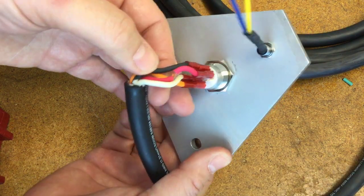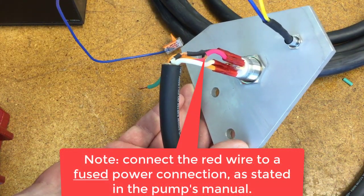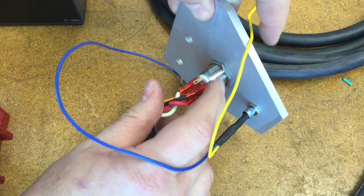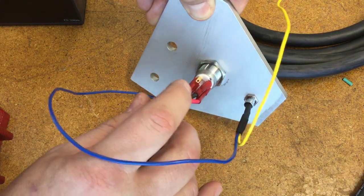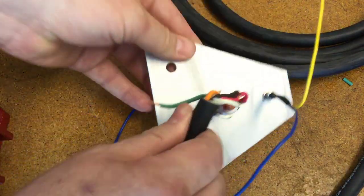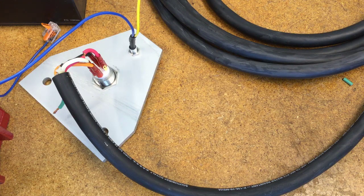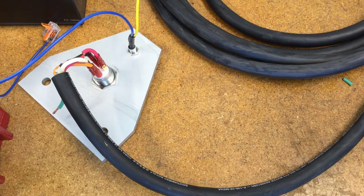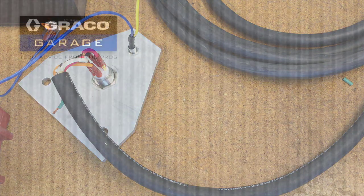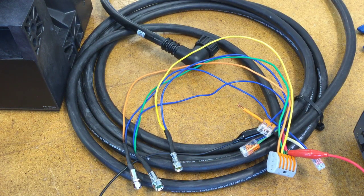If we power this up again, we'll have a green flashing light now instead of red. But this is kind of the bare minimum of what you need, in addition to having positive and negative connections to your battery or ignition coming in. This is still pin number three here, which I've marked with the black marker so I know where my black one goes. Then we put red next to it, and opposite black is where the orange goes, and opposite red is where the white goes. It's that simple. You can hook up a G3 SP to a remote manual run device just like any other G3. It's just that you lose the indication of the pump running — you only get a light when the pump is in fault or in warning.